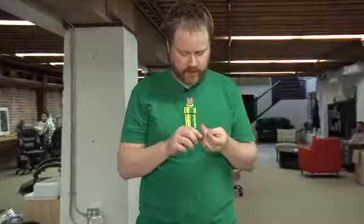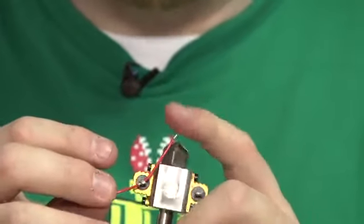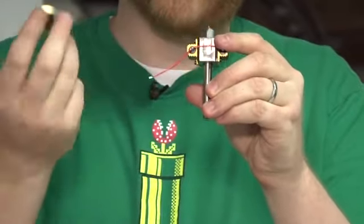What I'm doing right now is stripping this wire — I think it's PTFE wire. It has a different kind of insulator than a normal wire so it can withstand higher temperatures. It's going to deliver power to these two big resistors, which heat the whole barrel to get the plastic molten. The problem is you can't really use a wire stripper on it — you have to use a sharp knife and work carefully around the edges. You actually run it through one end, then put the connector on and solder it, breaking the insulator in the middle. It's a pretty significant challenge.